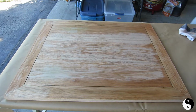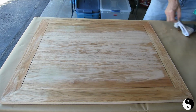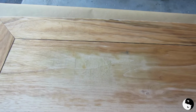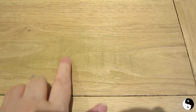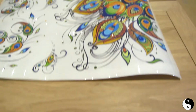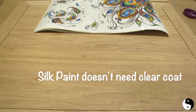So now you know you can sand that out, and since this is solid wood, you can sand it out and then wipe it with thinners to check your work again, if you want. But unfortunately we did get sand through. We blew through the veneer with our sander, so we've got this sort of ugly green spot, but the solution for that, I hope, is going to be some transfers. And then I'll clear coat the top and we're good to go with the bottom.